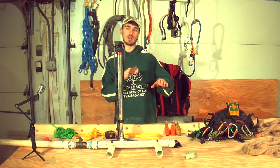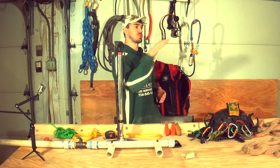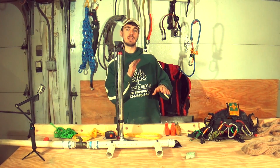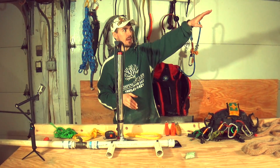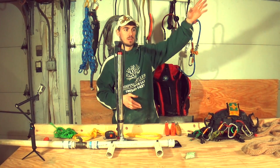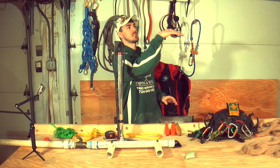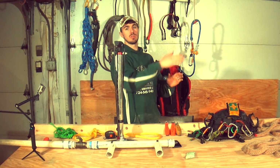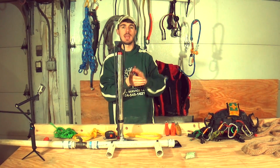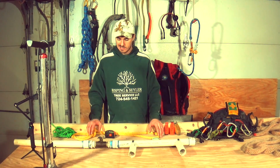What I typically want to do is have more power in the gun, because what I want to do is shoot more of a straight shot, right? I mean, I can put less in for a lob, but then it's harder to hit where I'm aiming. So if I have to hit a union that's 50 feet high, I don't want to just put enough pressure in there to just get to that union. I want to get enough pressure in there so I'm shooting through the union, so I get a nice direct aim throughout the entire flight of the throw ball.